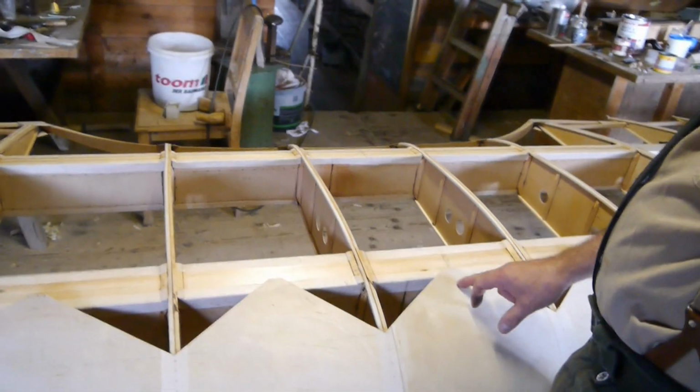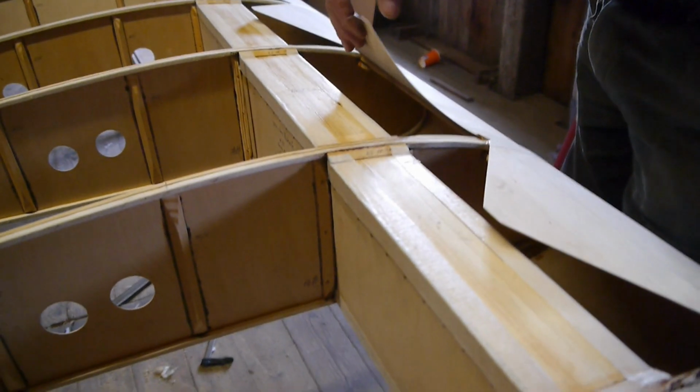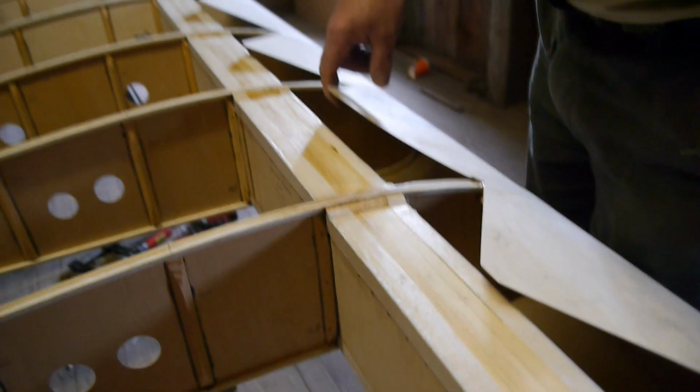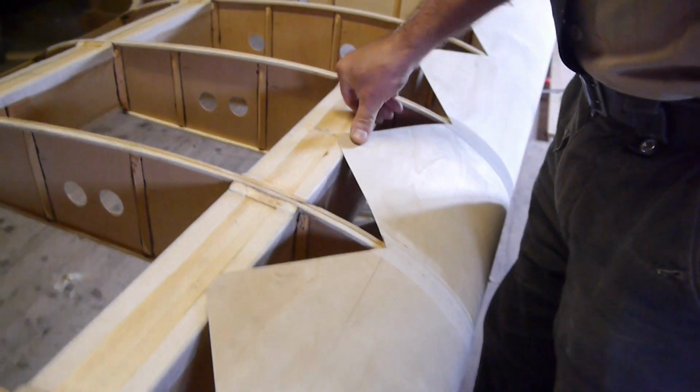The center flap of the leading edge, of course, has to be tacked down here. I do this as one of the last things. Otherwise, it may happen that the plywood leading edge gets under tension and doesn't lay properly. And this way you can get in with a brush and still varnish the inside. It's a bit tricky, but it works. If that is tacked down already, there's a little less room for the brush to get in. In this case, you should varnish it beforehand.